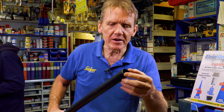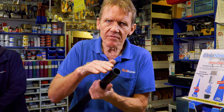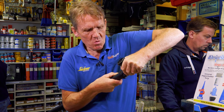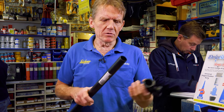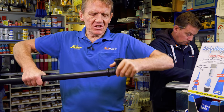For a DIYer it can do the job. The only trouble is that if you cut it, you end up with a square end, as opposed to what comes out of the factory which is a slightly chamfered, tapered end. If you cut it, you need to give it a light filing at the end to stop it damaging the O-ring. So the important thing with this is: cut it, chamfer it, put a little bit of silicone grease — not silicone sealant, silicone grease, or some people use washing-up liquid — and just push it in until you feel it hit the stop.